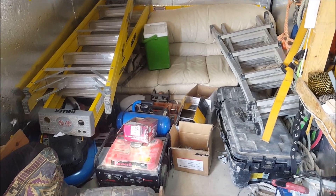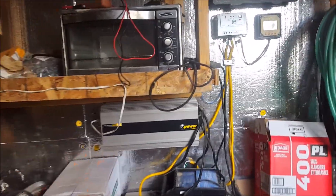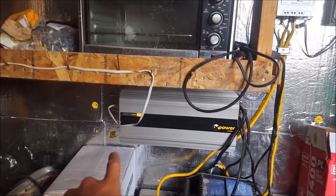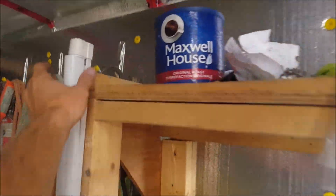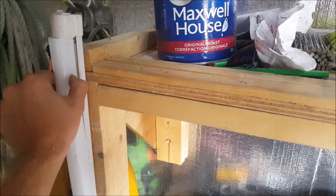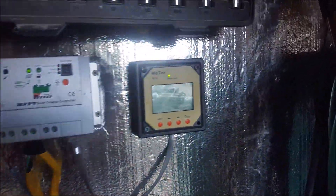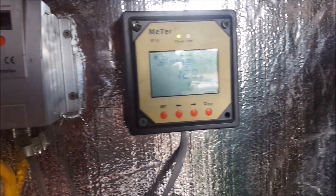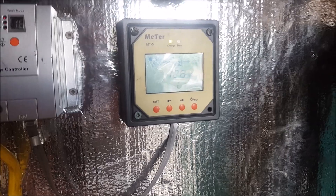The solar install is complete. These are just extension cords I get everywhere. My multimeter has a little light over here — looks like someone bumped it, and yes it definitely got bumped. It's cloudy right now with a big cloud over us, and the 125-watt panel is only producing 13 watts, so 1.1 amps.